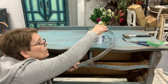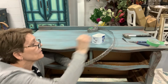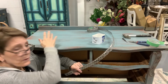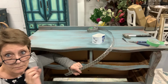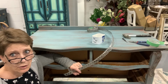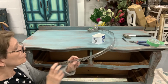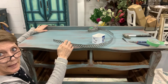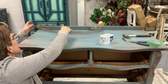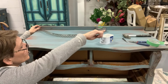Like what I've got are these 18 gauge, just 5/8 of an inch. They're little tiny things that fit with the depth of the wood that I'm nailing into. So you don't need them to be any longer than is going to hold it. And you certainly don't want it to be any longer than the width of the wood that you're doing. And here I'm looking at the back plate. So what I am looking at doing is wrapping this around from the back all the way across the front.